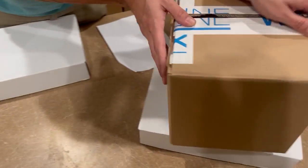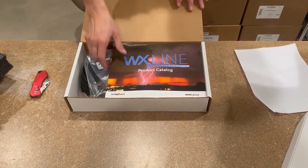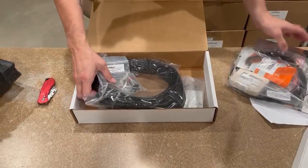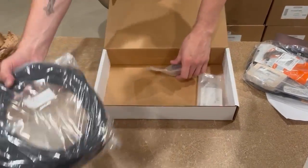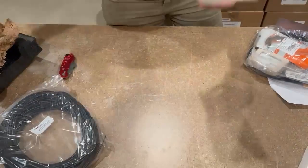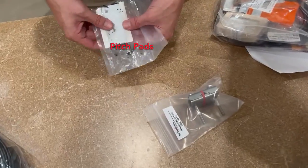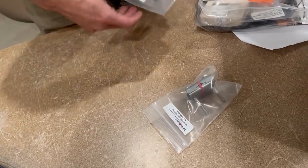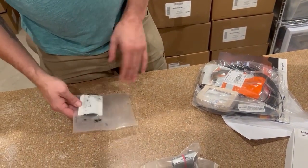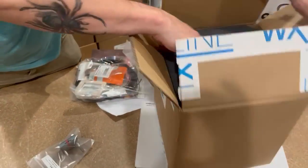The sensor connects to your lightning data receiver via fiber optic. In the accessories box you have your armored fiber optic cable, your sensor mounting clamp, and the pitch pads for the tripod. You place the pitch pads underneath the brass part of the tripod — between the tripod and the roof — and use the screws to bolt it in. Also included is your sensor mounting hardware.